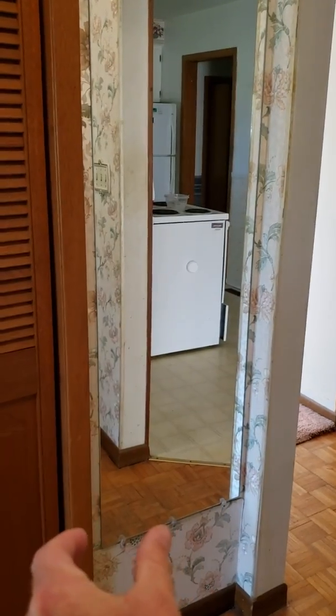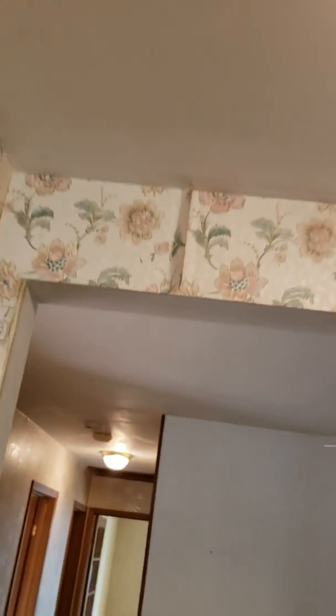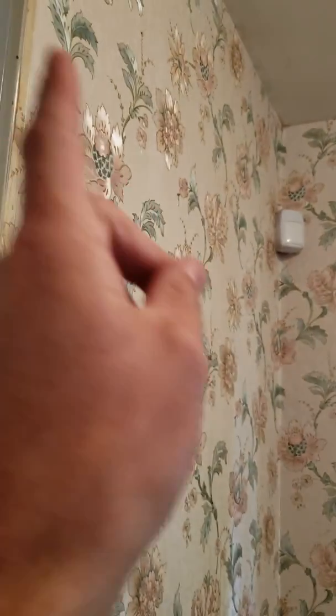We're going to keep this closet set up, but we're just going to shrink it. So we're just going to make it so that the width on this side is mirrored with the width on that side, okay? And we're going to keep the bulkhead lines. You see this little bulkhead line there that runs along? We have to keep it in order to protect the cove moldings. You see that? We don't want to redo all these ceilings. So to make it match, I think it would be smart to just carry this little bulkhead along to that point right there so that it matches that side, okay?